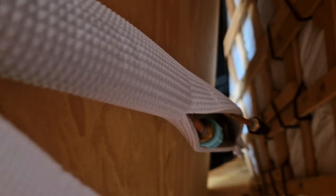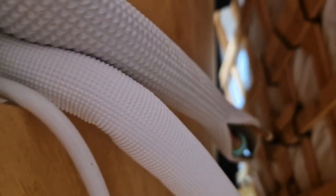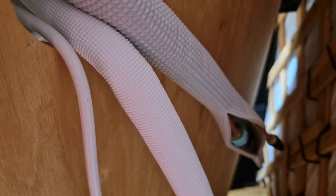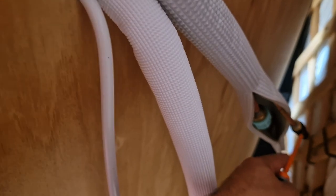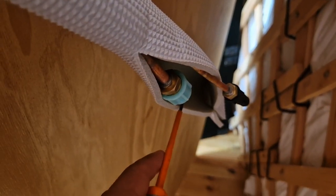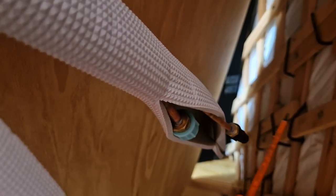And also, I can give you another tip, don't worry, when you undo this, if you hear, see, the air is coming, that means this unit is fully working, it's fully sealed. It means that when you put eventually the gas in, when you put the connection correctly here and there, this unit for sure is sealed. So if you will lose the gas, it means you did something wrong here or there.